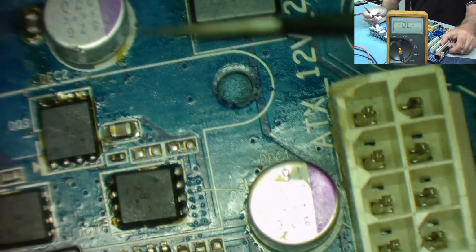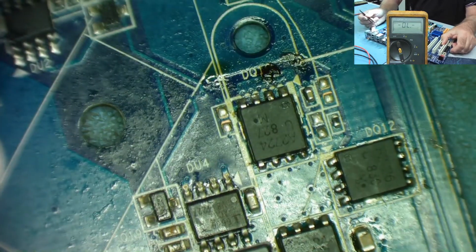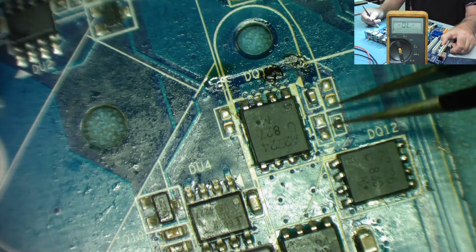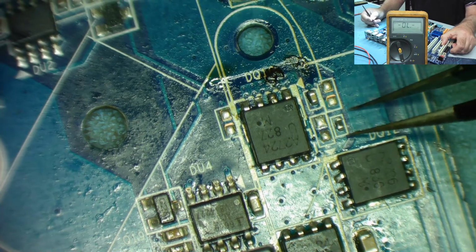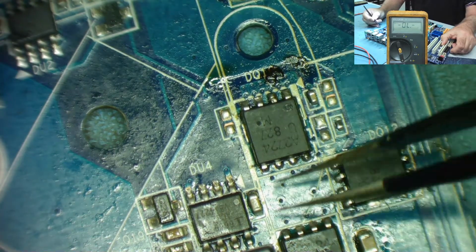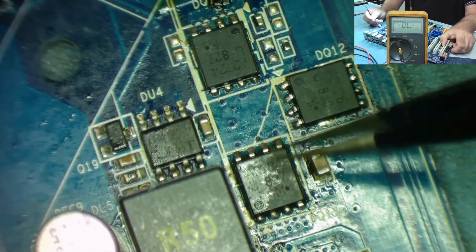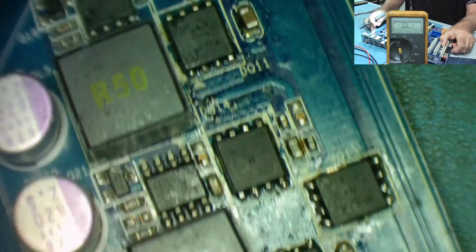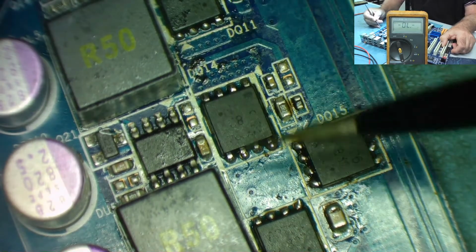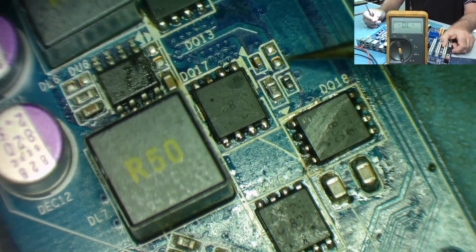And then we come down this side, and the layout's different down the side. And this is the one I'm sure has a resistor missing, probably from here. So there's the little black thing, there's the capacitor. The big capacitor, probably one of these around here somewhere. Oh no, the big capacitor's there. Now if we look at the next one, this has the 2R2 in here, which seems to be missing. Little capacitor, black thing, big capacitor, and then the last one, again, 2R2.